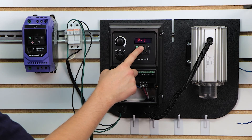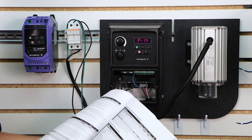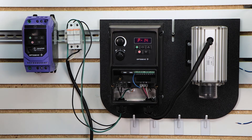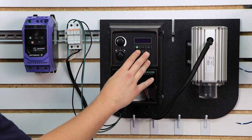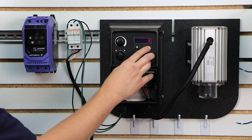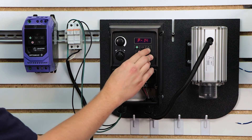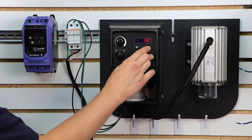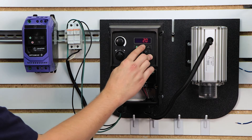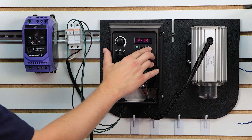Finally, P14 allows us to modify our parameter set beyond the basic parameters — it's a parameter lock. By default the drive locks out any parameters above P14. To unlock standard parameters beyond that, you have to set this to 101, which is a passcode — this will give you access up to P50. Beyond P50, you set it again to 201, and that gives you access to P50 through P60. This is a very common question we get: 'I can't get past P14.' Unfortunately the manual isn't exactly clear on how to get there.